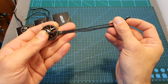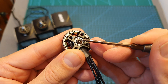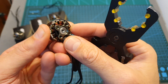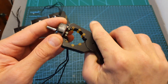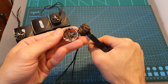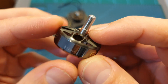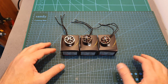It's using 15 centimeter long 20 gauge silicone wires and its motor bell is secured using an M3 screw. After removing the M3 screw you'll be able to detach the motor bell. Since these are pretty strong magnets, I recommend using a motor grip tool to hold the base of the motor and then remove the motor bell. Here you can see how the motor bell looks on its top side — you can find a grip pattern for the propellers, and on its inside you can find 14 high quality magnets.